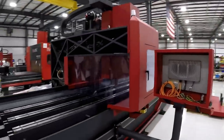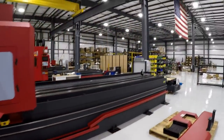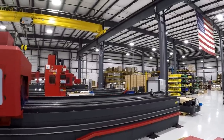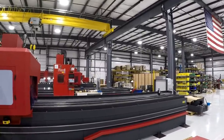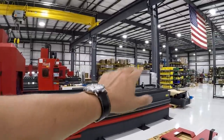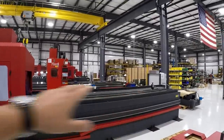Well, look at the capacity. Look how big this is. And you could take a large workpiece. Let's say a lot of guys know that I work on large shafts. Right. So if I had a large gearbox shaft, or just a large shaft that's got multiple keyways milled down it, we could set that in this machine right here, right? Yeah, and with a single pass. Right. So you'd have several vices mounted up in this machine, and you could just do all those keyways in one setup.